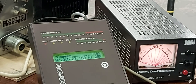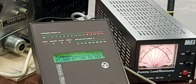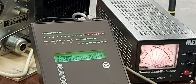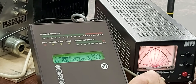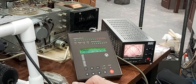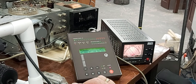So we'll take it off of operate — we're on standby. Undo the clip, drop it down to 5 watts, and you'll see a remarkable difference now. Down to 5 watts, clip it up, key it up. Into operate. We are now into operate. Let's see. We're about 100 — there's 100 watts there. We're about 75 watts — 75 watts at 5 watts input.